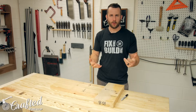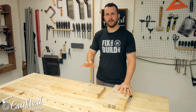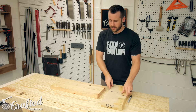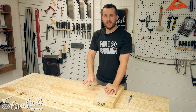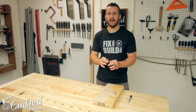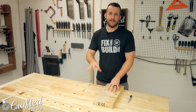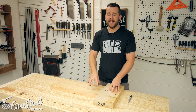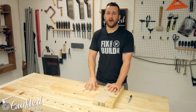Let's talk about breadboard ends and why they even exist. A lot of people just like the look of covering up the end grain on the top panels — it provides a nice clean look. The other nice function is that the breadboard itself is going to stay pretty flat and it can keep the top panel from cupping over time. Now let's talk about how you're supposed to install a breadboard end. I see a ton of people, especially with farmhouse style tables, install these in a way that does not allow for wood movement — and that is one of the critical factors. If you just use pocket screws and screw your breadboard onto the center panel it's not going to allow room for the panel to expand and contract, and you're probably going to end up with bowing, cracking, or something going wrong with your top.